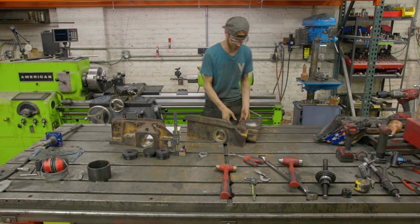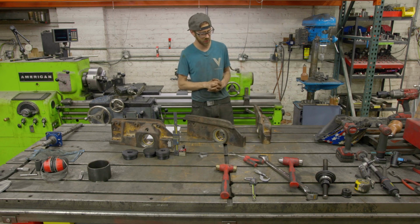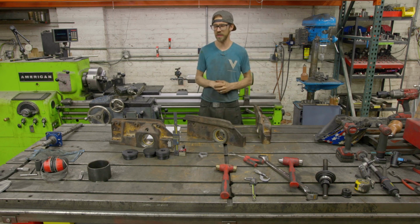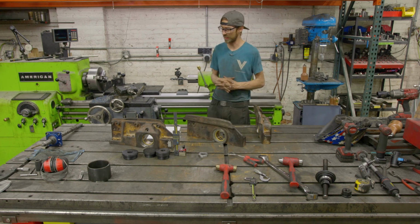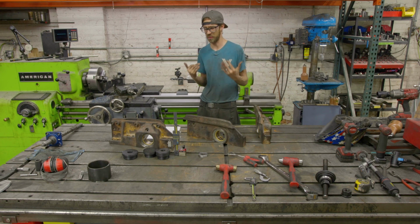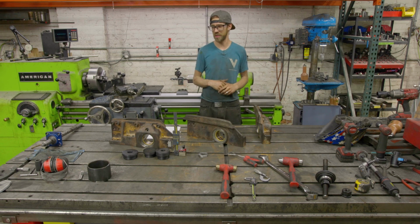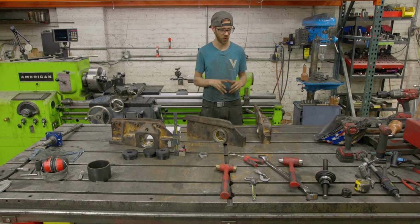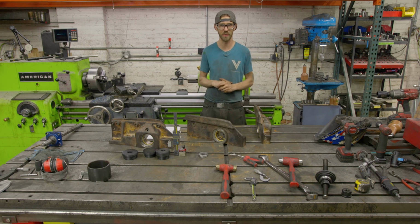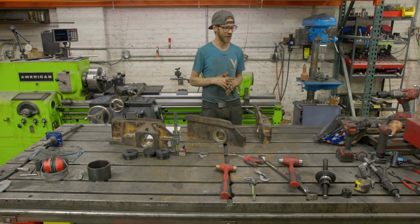Drilling out the grease fittings. The last one that I did on that excavator boom, I drilled out the fittings, no problem with a standard drill bit. But these ones, I think, because of the way they failed and the use case, were super hard. I started with a normal drill bit. That had no chance. I actually drilled all 3 of them out with a carbide drill bit, but I went through a couple different carbide drills, and it was a huge pain in the butt.